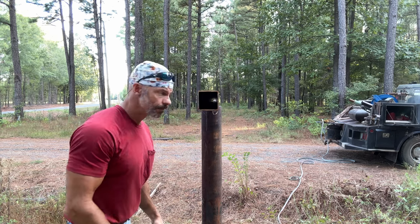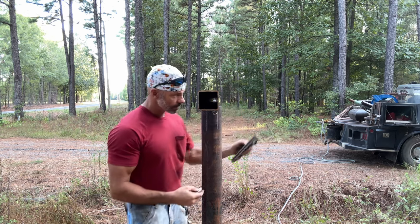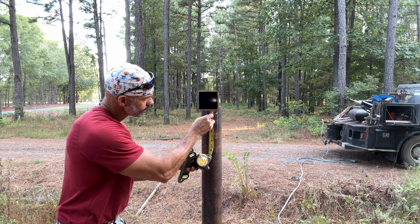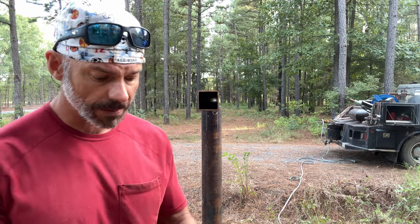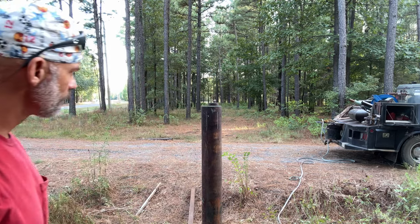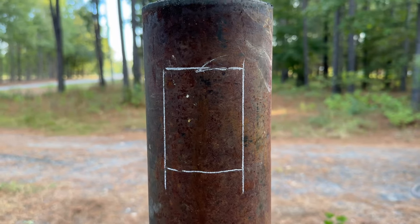And that's the side of your square tubing. Do the same thing to the other side — flat against the pipe, flat of the soapstone against the square, the level, and then down. Then I measured two and a quarter down and I made a mark. And then off like the second one that was getting better, I made me a little template because it just makes it easier. So after you get these lines, you can hold your template up here and mark out the top and the bottom.